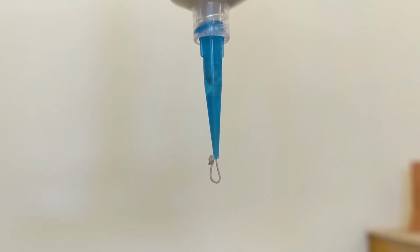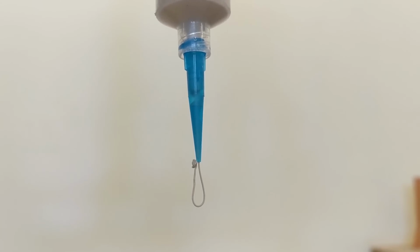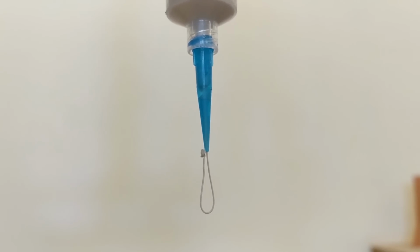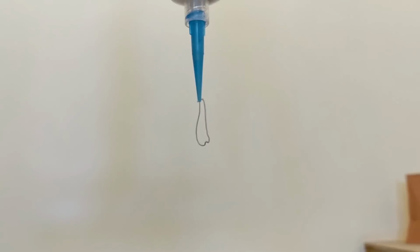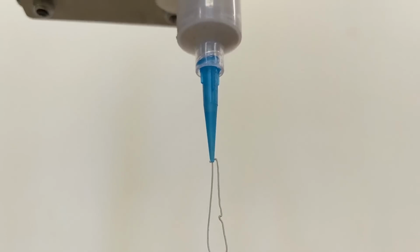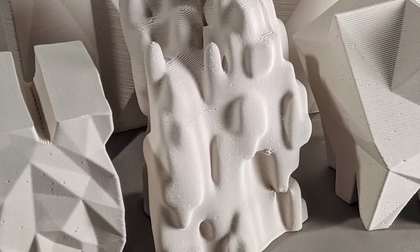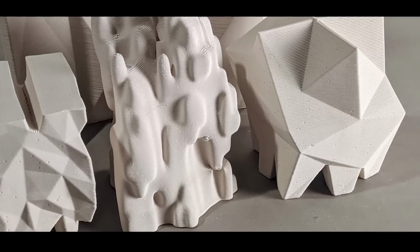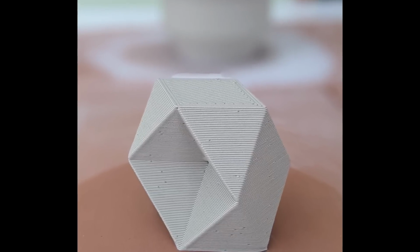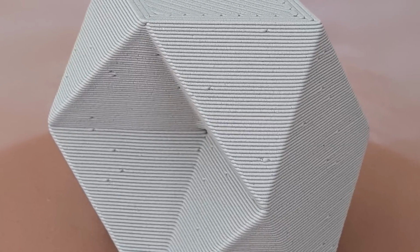And an important decision for me personally was to try and really shrink down the size of the extrusion. So what you see here is a print nozzle that is about 0.5 millimeter in diameter, and that is basically in parity with a plastic FDM printer. And so the idea has been to just match up diameter to diameter and capability to capability and process to process with a plastic FDM process. That's my personal approach. Obviously there are tons of different approaches to clay printing out there.